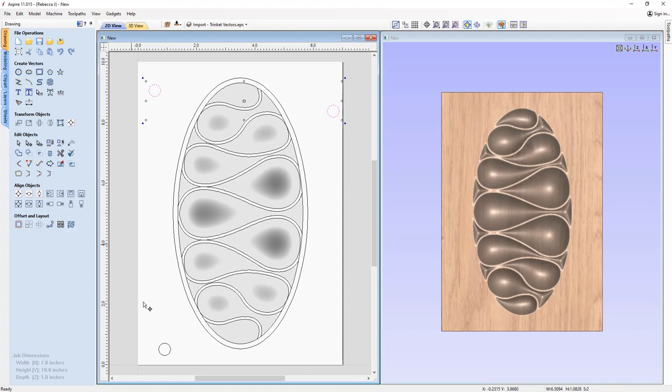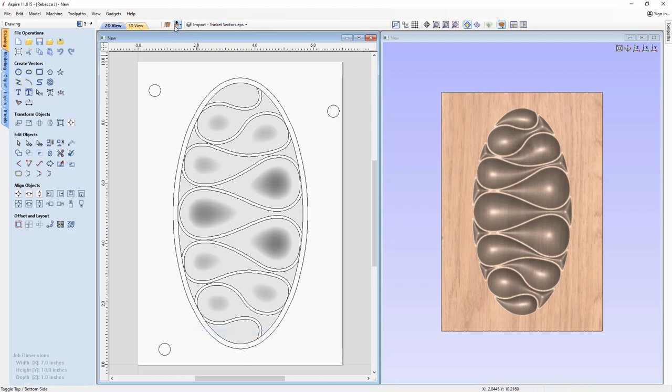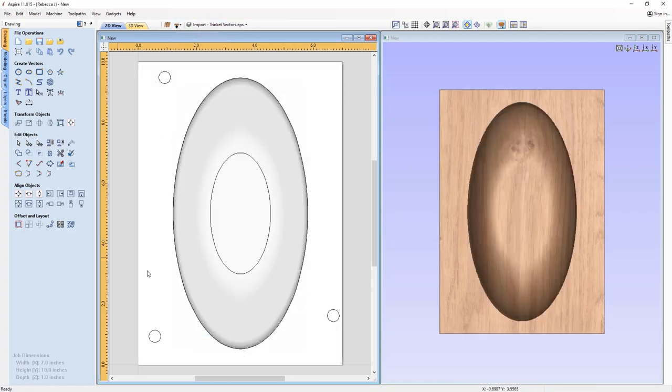We're going to machine the pockets into the top side of our material with those vectors. Let's copy that over to the other side. And then on the other side, because the software automatically kind of flips that for you, we're going to take the pattern on the bottom side and we're going to machine those vectors into our spoil board. And then ultimately our dowels are going to connect with the holes on the bottom side. And then everything's going to be perfectly aligned in X and Y, which is perfect. Okay, so that's the alignment.